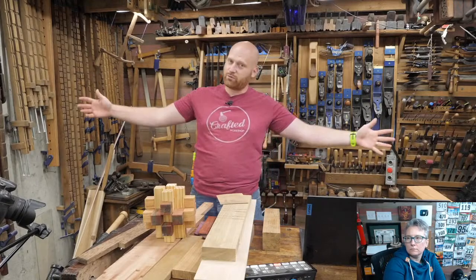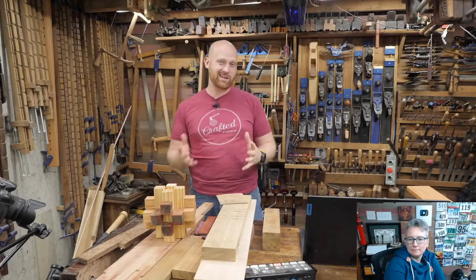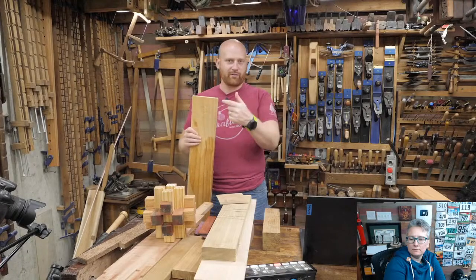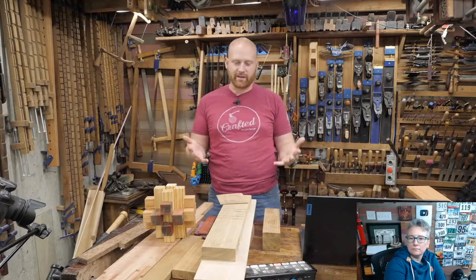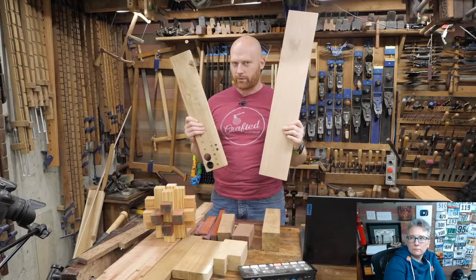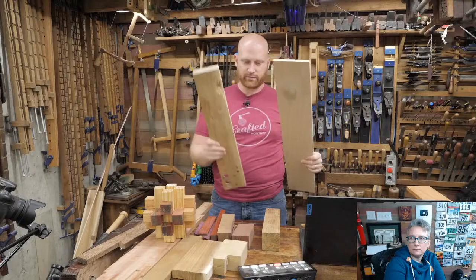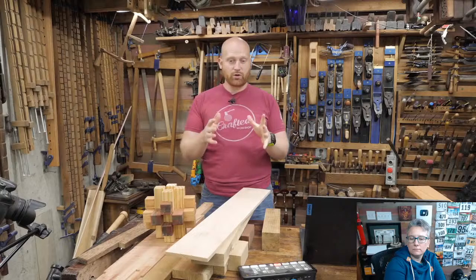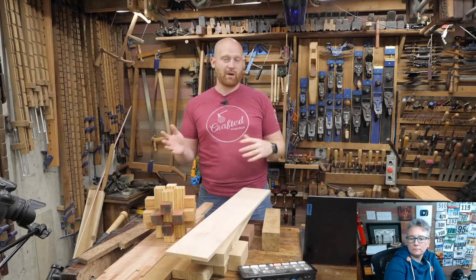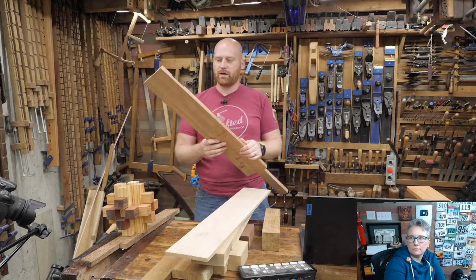If you're making something like a dining room table, you want something that will stand up to abuse — kids dropping things on it, banging into it — you don't want something that dents easily. Pine has a very low Janka hardness and you'll get a lot of dents. Some comparisons are a little counterintuitive: white oak is usually harder than red oak, but not always. Cherry is a really nice wood to work but can be a little soft and dents pretty easily. Filipino mahogany has a very low Janka number — it's really, really soft, almost feels like balsa sometimes.